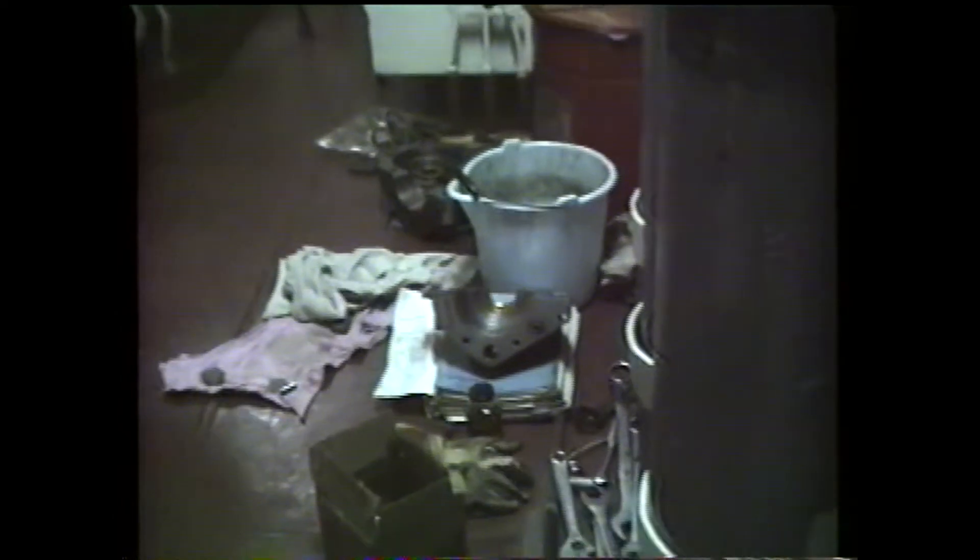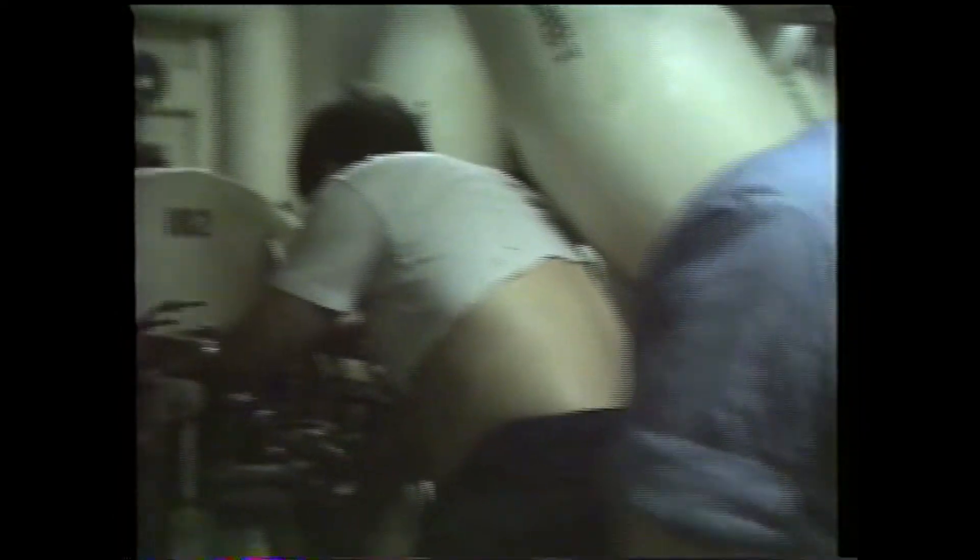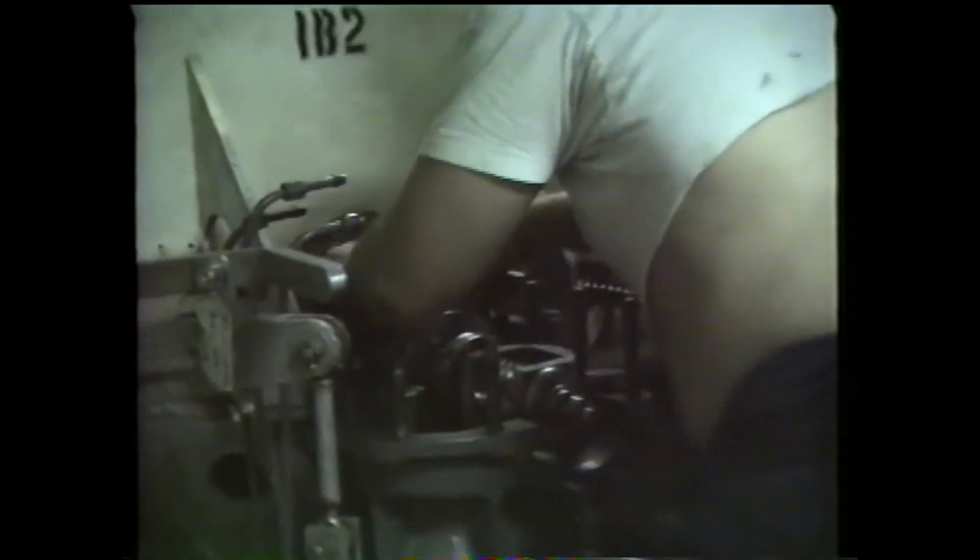Once you get it in, then it's fine — you can't do the pins anymore. If you compare the other one we had to replace with this one, the other one had a real smooth finish on it. This is a real rough finish Kingsbury bearing, and it's giving us a problem because of that.